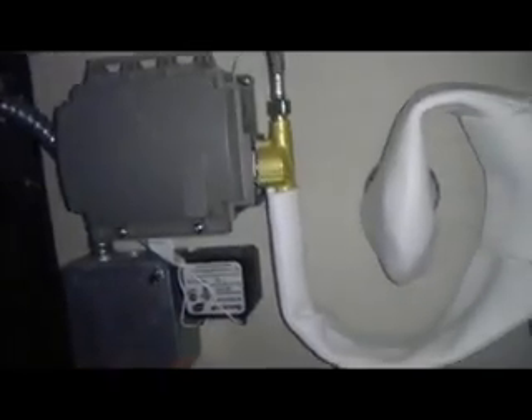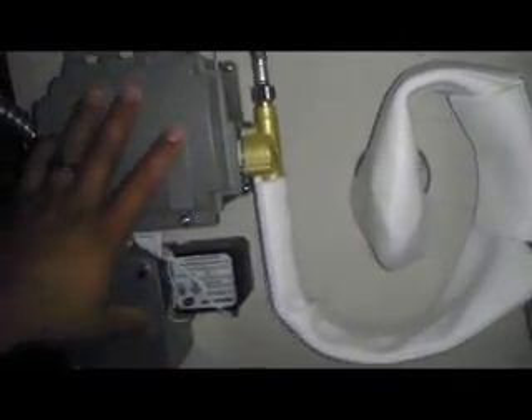The reason it's important to keep them separated is that if you're using a battery-operated faucet you shouldn't have any problem, but there seems to be an issue with interference from 120 volts going through a transformer. So it's very important to hook up this unit to ground and keep the sensor cable far away from the power cable. This is something not really mentioned in the manual, but after quite a bit of installation experience, we realized that problem.